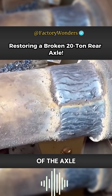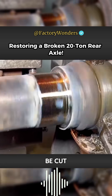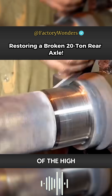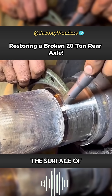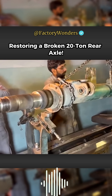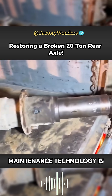Because the outer side of the axle head needs to be installed with the axle travel, the rough welding bar needs to be cut to restore the original appearance data of the axle head. After measurement with a high precision micrometer, the surface meets the axle travel requirements, and this large semi-trailer unpowered rear axle can continue to work. This kind of maintenance technology is really amazing.